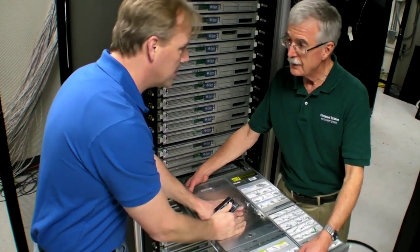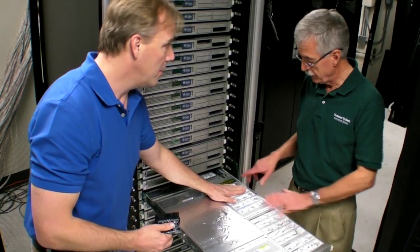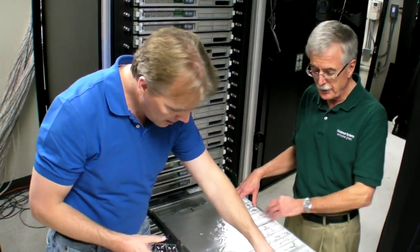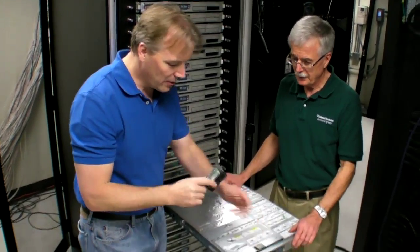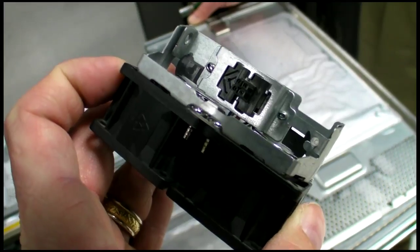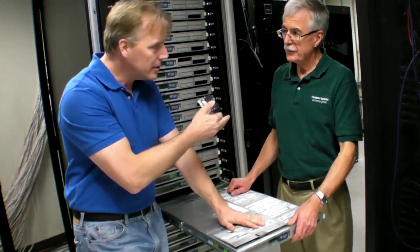The power supply and fans are here, and that's because we just don't have any contact-cooled power supplies available yet — we have them in the lab but not here. Engineer-wise: each one of these fans is 10 watts, and there are 12 of them inside the cabinet. Basic math shows that's 120 watts of max-load fan speed — enough to cool this with air.